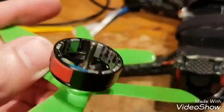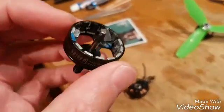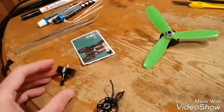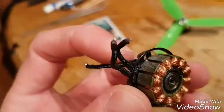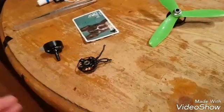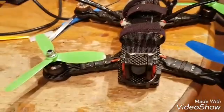All those black marks and magnets that I've had to re-stick back in because they split motors. This is what they can end up looking like — this was a particularly great example, the first one that failed. The magnets come off, chewed through the power to the electromagnets, pop it out of the sky. When I looked, three others had started dropping magnets.